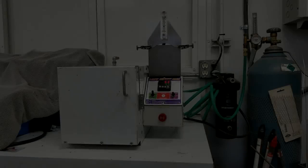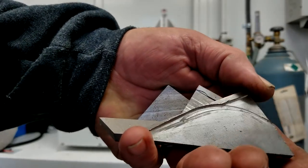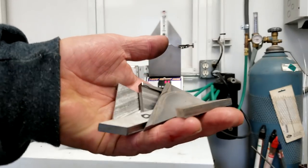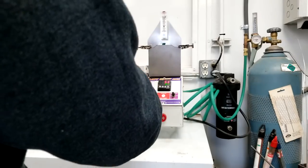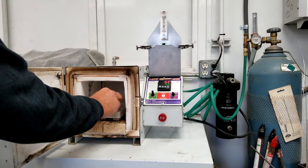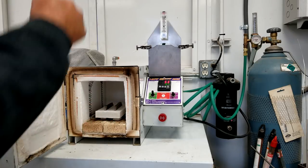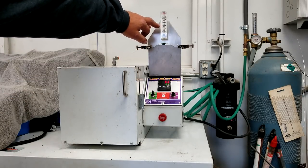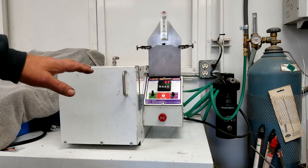I've got some little bits of junk — some scraps of O1 squares, a few pieces of O1 tool steel. We're going to test with that and check for scaling. I've started a little purge but I'm going to place a couple of scraps of O1 right in the center underneath the argon tube, close the door, and wait 20 minutes. I'm flowing four cubic feet per hour on the flow meter — a real gentle flood — and then I'll start the cycle.